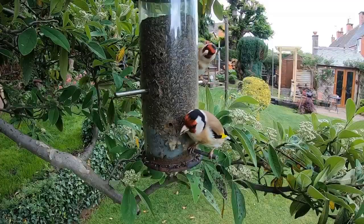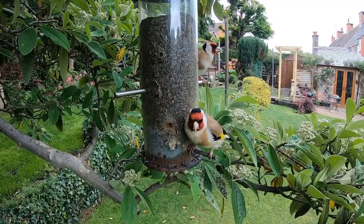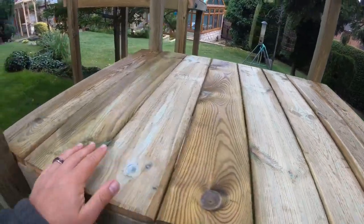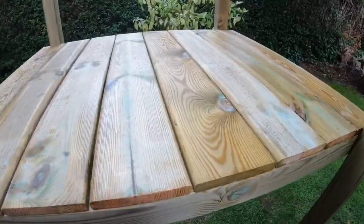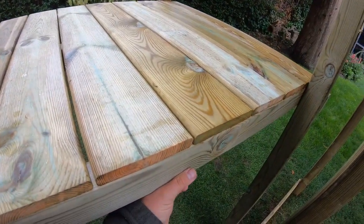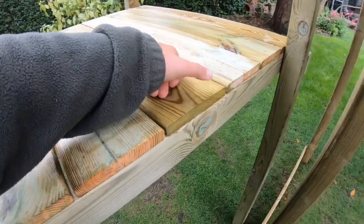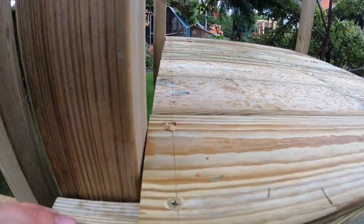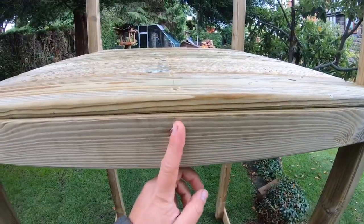These are the boards just laid out by hand, flush to either end and evenly spaced just by eye. It does call for measuring in — even despite these beams being 44mm wide, it still asks you to mark in 25mm rather than 22mm, which you'd think. That's purely so you don't want the ends of these boards splitting. You can see up there the ones I did yesterday, marked out nicely and evenly — that one's obviously bang in the middle at 22mm.